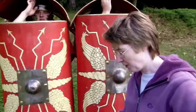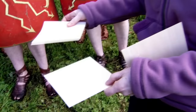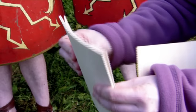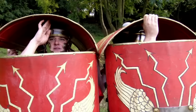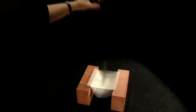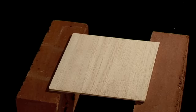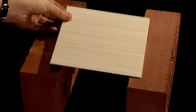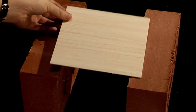Plywood is very easy to make — just take a few layers of wood and glue them together with the grain at 90 degrees to each other on the different layers. That provides protection that's fairly firm but still a little bit flexible, and that's how they're able to produce these curved shields. Laminating the alternate layers at 90 degrees gives the shield its strength. Drop a marble on a thin sheet of wood and it breaks easily. Put two sheets together with the grains in the same direction and they still break. But cross the grains, and the marble bounces off.